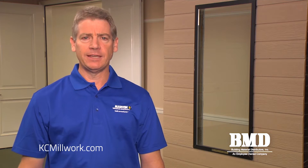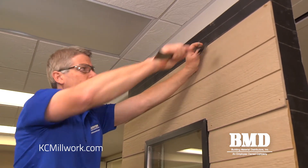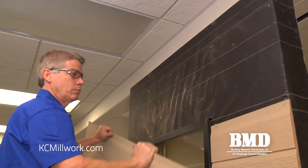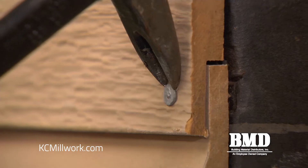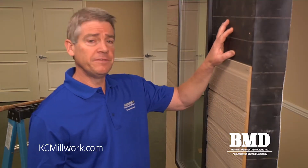There are a lot of different siding conditions in California. What we're going to show today is how to remove a horizontal lap siding to open up the wall, and then install and properly flash a new Marvin clad window in its place. Once we have the siding removed we're going to make sure that our weather resistant barrier — the paper that keeps the building dry — is intact and doesn't need to be repaired. When we remove the siding what we found is 15 pound felt paper, which is acting as the weather resistant barrier and is really common in homes in California.